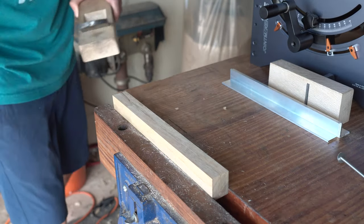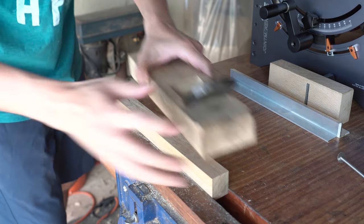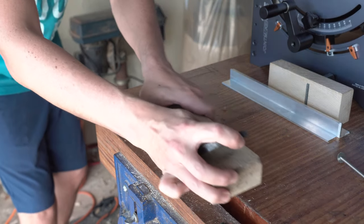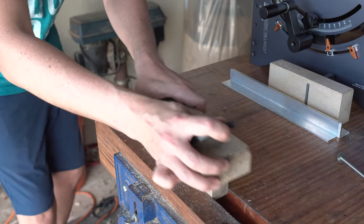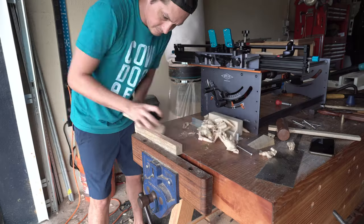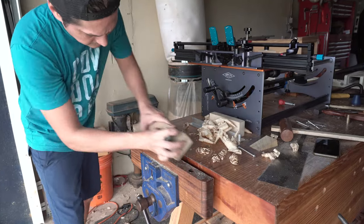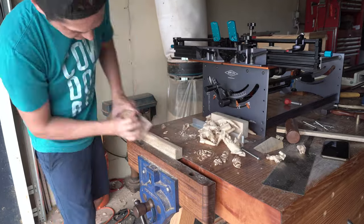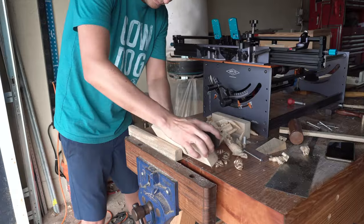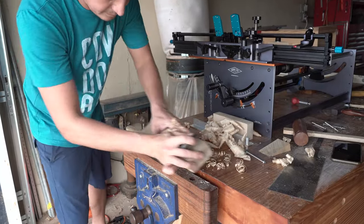Now that your handle stock is once again a full stick of wood, you have to make it more hand-friendly. You can do this in a variety of ways — a cool octagon pattern on the table saw, or a router if that's your fancy — but this is a channel with a heavy focus on hand tools and Japanese tools specifically, so the kanna will slowly round everything out and get it to feel nice in the hand. A curved-bottom kanna would be nice, but for now just kicking it up on an angle will do.